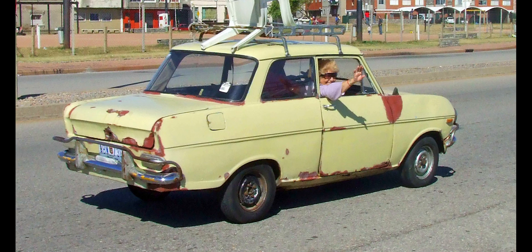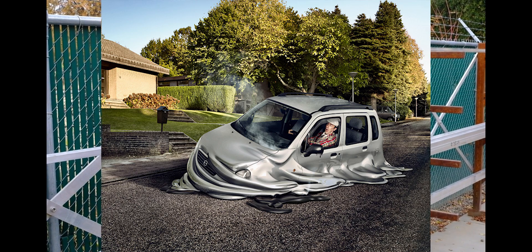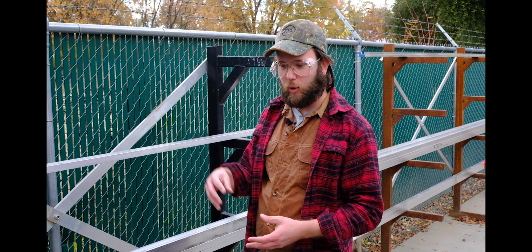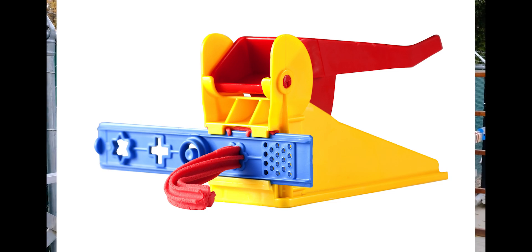So they take your old car and they chop it up, put it in a melter furnace and melt it into a big ingot, and then that ingot gets melted again and goes through a die and gets pushed and pulled and extruded into the shapes you see behind me.